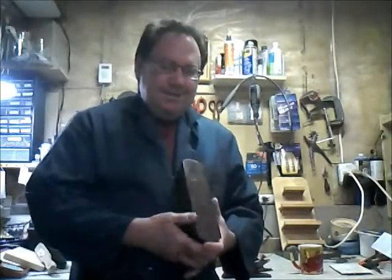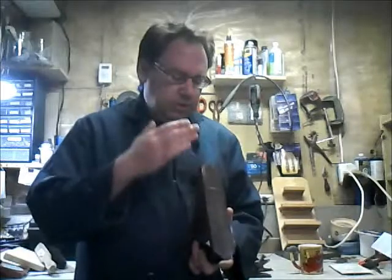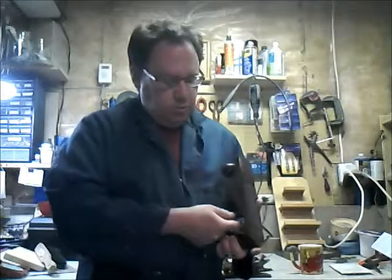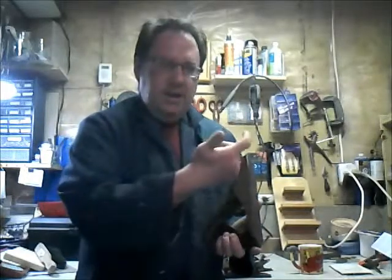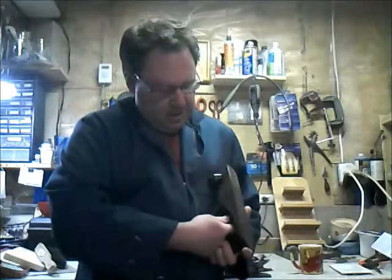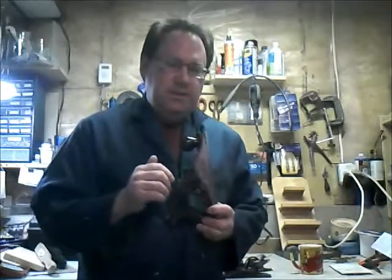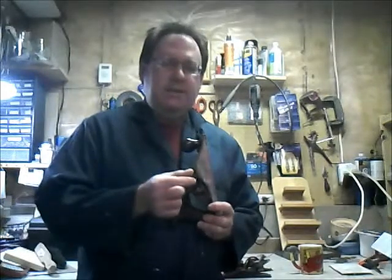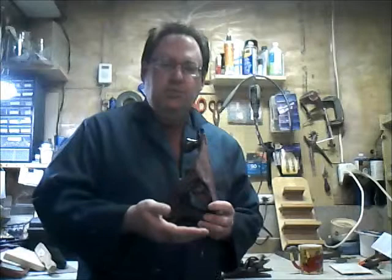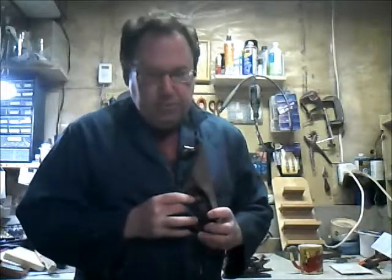As you're holding it like this, this is something you need to do standing up — not sitting down. Stand up next to the workbench and put the heel down. With one hand — I'm right-handed — I'm going to hold the gold adjusting nut with my right hand and turn it in a counterclockwise direction. Now, these adjusting nuts are going to get loose and then tighten up. Once they tighten up, keep going — don't stop. That little play in there is just to allow the adjusting nut to engage the blade so it can start to do your final adjustment.